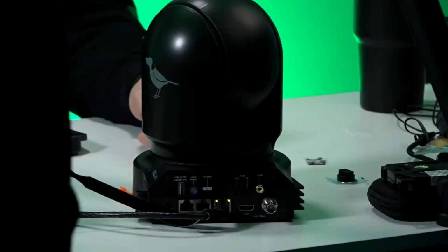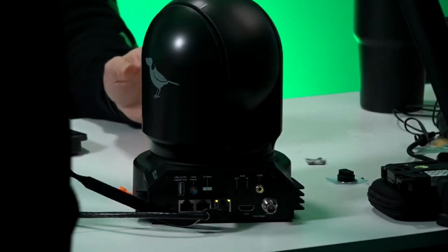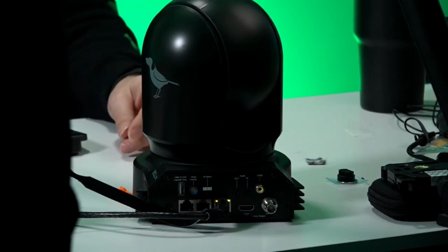And so, for example, there are matrix switches on the bottom of this camera, which I can show you in a minute. Those matrix switches need to be in default. The rotary dial needs to be in default. Leave those in default unless you're not using this BirdDog camera for the BirdDog features that we've created, okay? So if you're just SDI out and you're doing 232, you can change the resolution there, but your results may vary. Our focus is making it all NDI compatible, doing everything on the web UI for alterations. Okay, so that rotary dial for the most part needs to just be left in default.